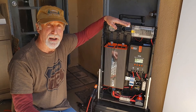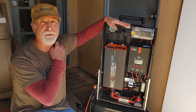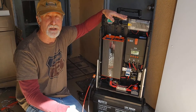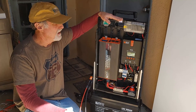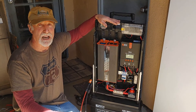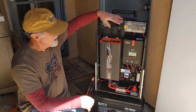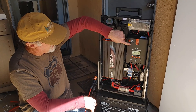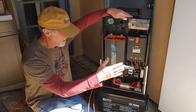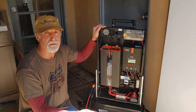So what I'm going to do now is go get a blow dryer and plug it in here and see what this does. I've run two refrigerators overnight on this, no problem. I ran an old microwave off of this — it took about 1,625 watts and it ran fine. The whole idea is to keep your refrigerators running overnight or just use it as a backup power unit. It's a nice setup and it's completely modular, so if one piece goes out you can just replace that piece. You could also add another charge controller and have another 400 watt array, so you'd be bringing 800 watts in to charge this battery. So let me go get the blow dryer.